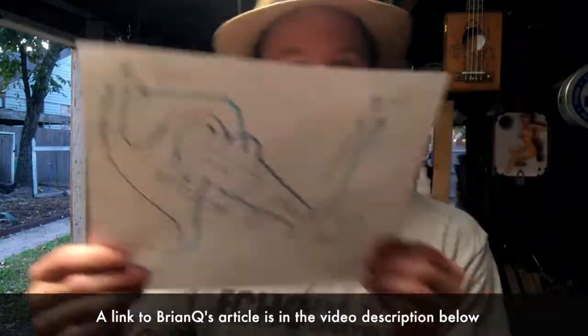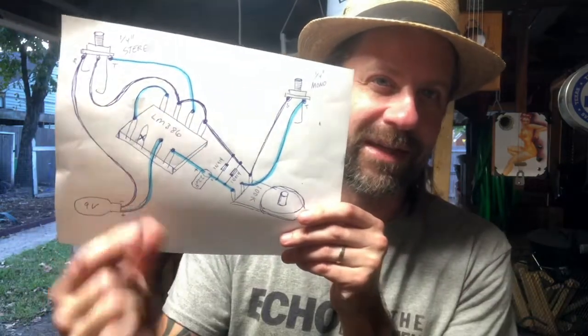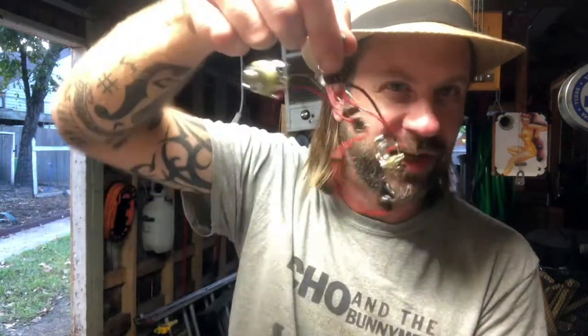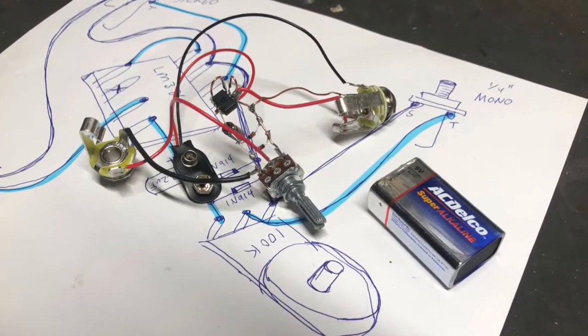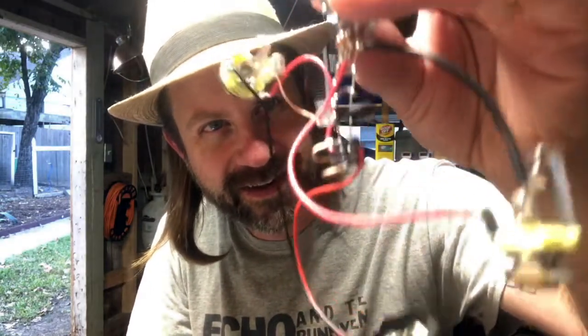He basically said maybe he could turn this into a dirt box, so he prototyped it and posted the schematics. He asked that I not repost the schematic, so I'm not going to put it on screen. But I took his design and dead-bugged it. A dead bug is when you take an IC and flip it upside down so all the prongs are sticking up. I built it — here it is. It's ugly, it's not pretty. There's the IC, and I just soldered everything around it.